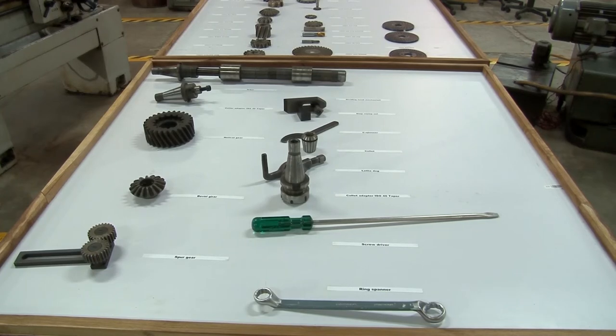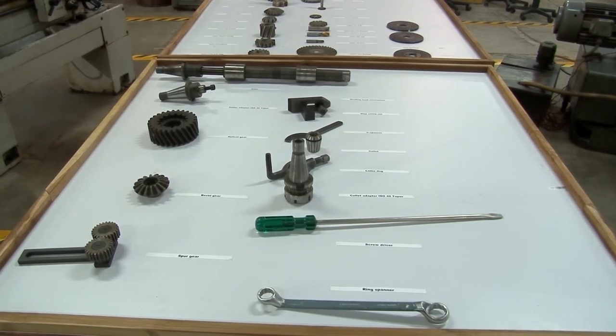In both of these milling machines, different kinds of milling cutters are used, which we will show you here. Cutters like the end mill and face milling, for example, can be used in the vertical milling machine. In the horizontal milling machine, we basically have flat surfaces, slotting, and various kinds of grooves made. Here you see different components and the tools that are being used.